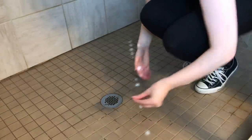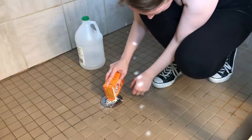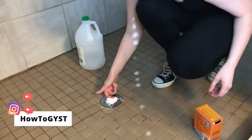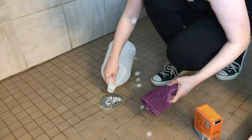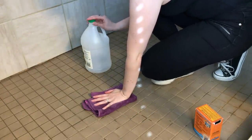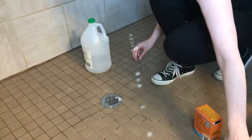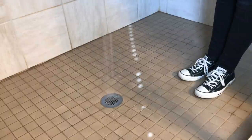It is really important to clean out and deodorize your drains on a regular basis. First, chuck some boiling water down there to loosen or melt any grease or grime. After that, pour half a cup to a cup of baking soda down there — for most drains half a cup or even a quarter cup, but for the kitchen sink and garbage disposal use a full cup. Then pour a cup or two of white vinegar down there. This will all fizzle up, so make sure you are covering the drain so it pushes everything down and clears out the pipes rather than coming back up. Let it work, then follow up with more boiling water to wash away any last remnants. Both the baking soda and vinegar will deodorize and sanitize your pipes, getting rid of those nasty smells.